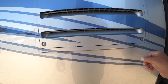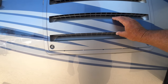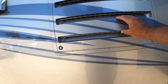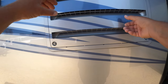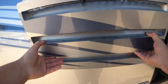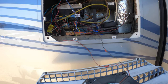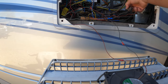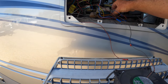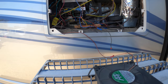I'm removing the outside panel to the rear of the refrigerator. I would suggest you pull the fuse for your refrigerator in the fuse panel — mine is a 10 amp fuse. I pulled that first to make sure there was no 12 volts running through there. I've also already pulled the fuses for the fans and for this ARP controller that I had on there for about six months that ended up failing.